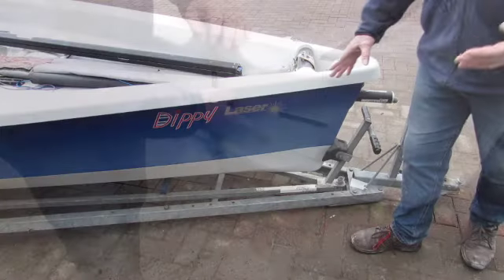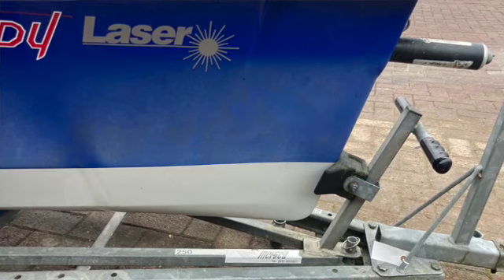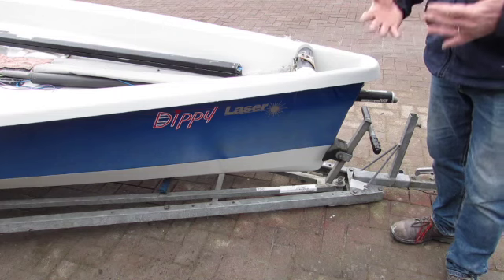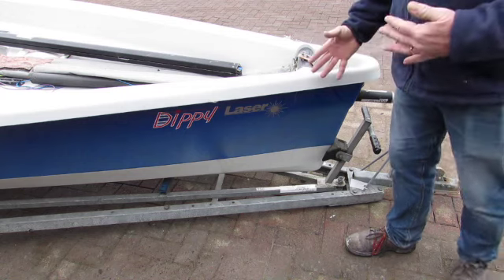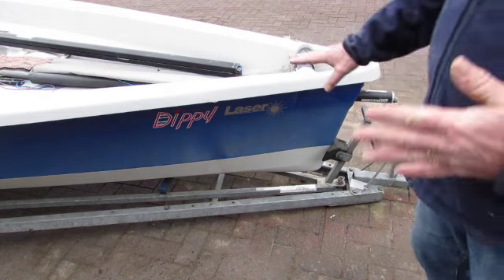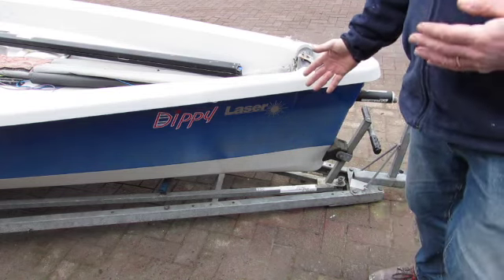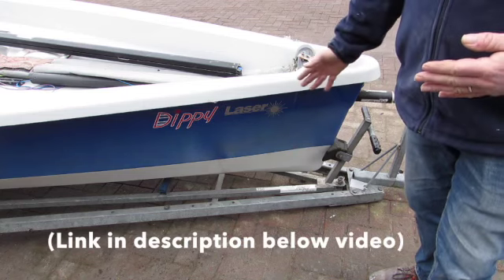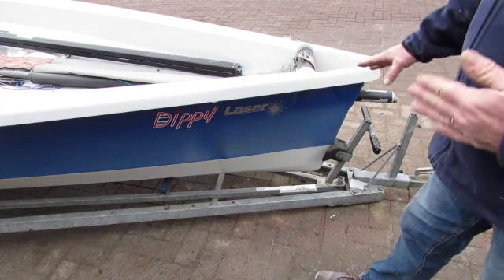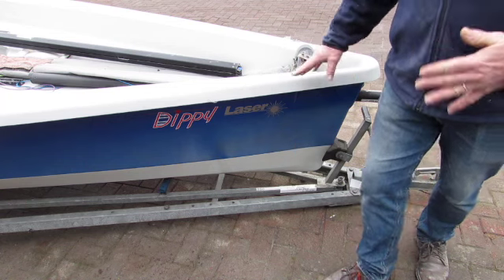The first thing you might notice about this boat is this colour-fade area — very common on older 2000s. This is actually UV light deterioration, an oxidization of the top surface. It's purely cosmetic — no problem at all, not going to do any harm to the boat whatsoever. In fact the boat could stay like this for another 30 years and not see any ill effect. We've done another video showing how we've restored the colour on a boat — link below. It takes a bit of manual work but you can get it 90% back to what it was originally. If you want it tackled, it costs around £250 for somebody like us to do it.